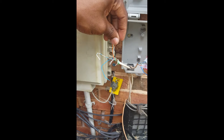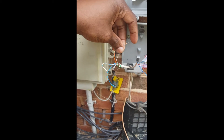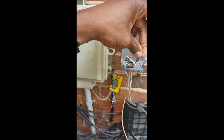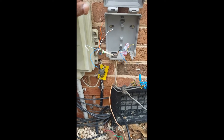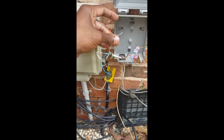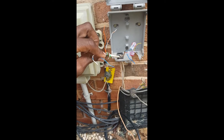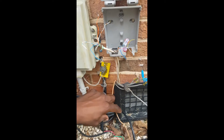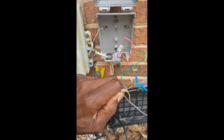So the only thing that the dial tone is coming from the MTA is this line here. These other pairs are not even going to be used for anything. If there was a phone in there, then yes they would be used and put back into the loop with the rest of the house phones. But since there's not a phone in there, those guys won't be used — the only thing being used is the dial tone, which is going to be connected to the security.